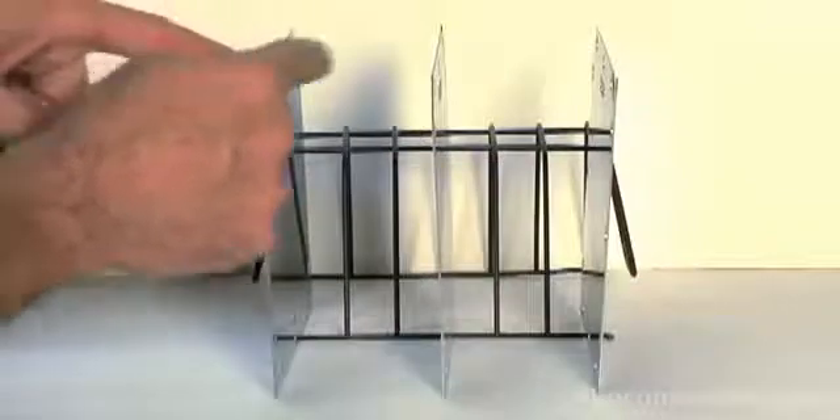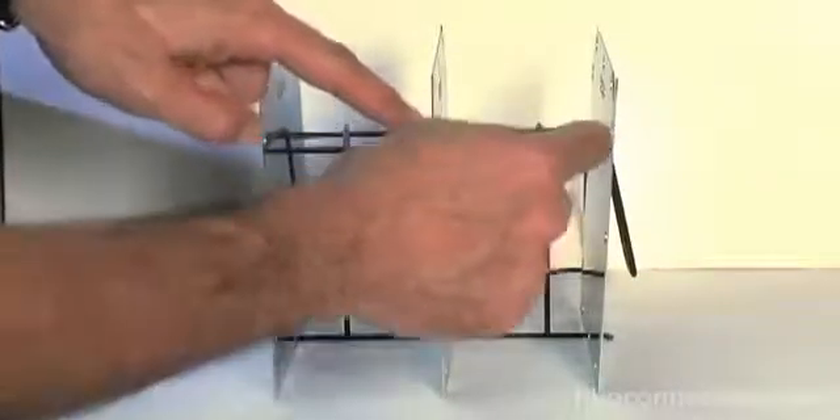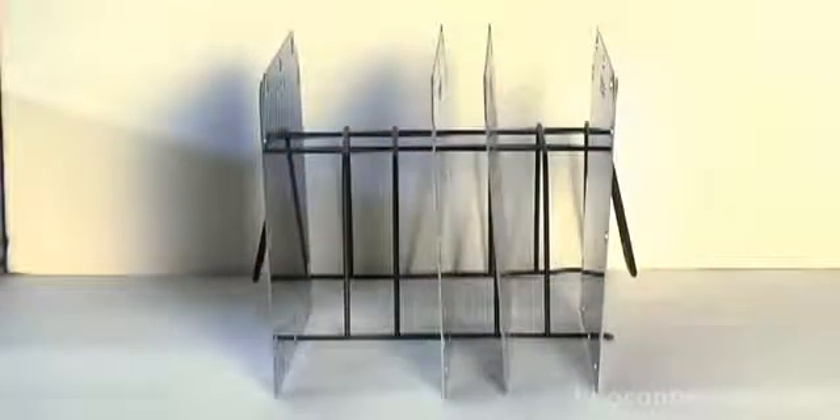So if I read between this plate and this plate, it's going to read 6 volts. And if I read between this plate and this plate on the other side, it's also going to be 6 volts. Every time we drop another plate in between, it makes another gap, and we have to divide our 12 volts by that new number of gaps.